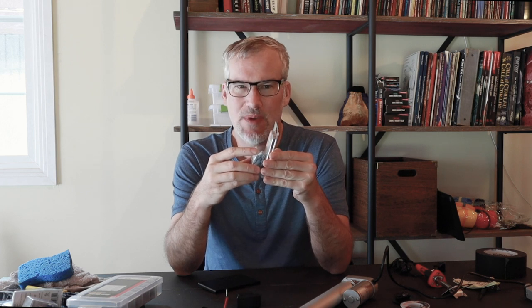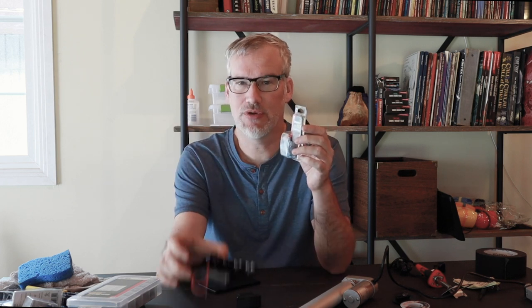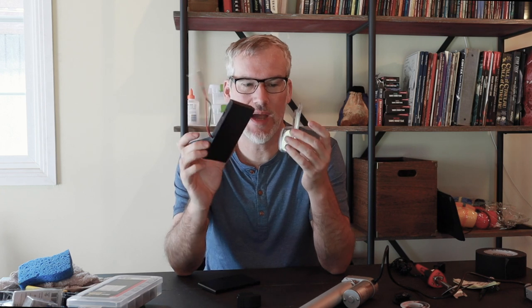And my idea is to make it so that I can take it apart, so I can disconnect the battery pack from the motors from the switch, so that if we have to make changes along the way, or even maybe months away, like a new change out of the wings or something, I can just disconnect the motors from the rest of the system instead of having to cut wires all the time. So I'm using these connection pieces, males and females, so we can connect everything together and disconnect. And I think that will all be safe and tidy also. I want it to be tidy, so there's not wires everywhere.